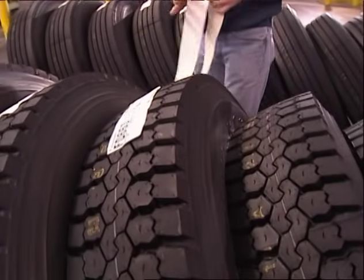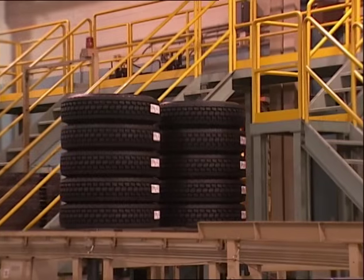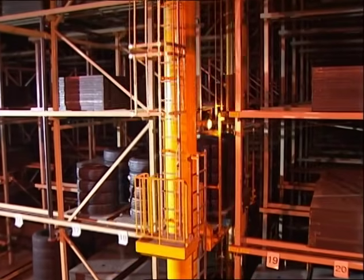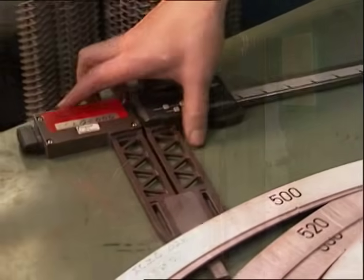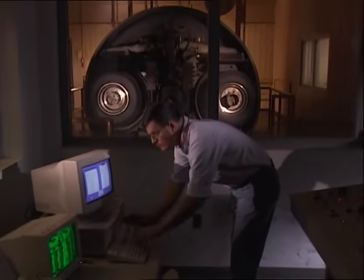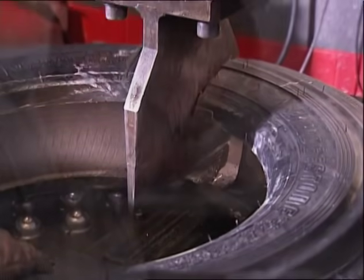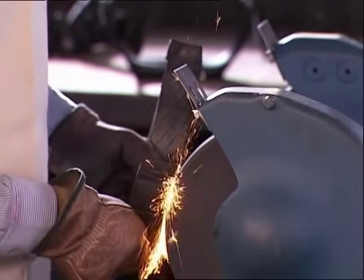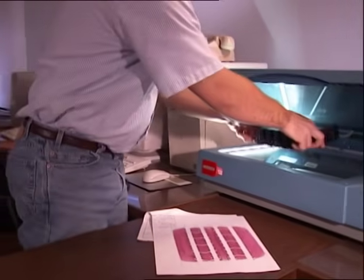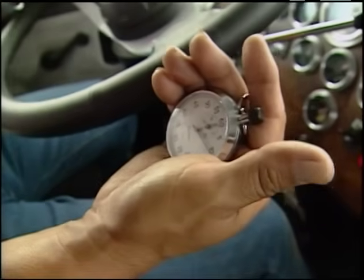Tread patterns and sizes are sorted, labels are applied, and the tires are sent to warehouse areas for shipment. At this plant, a robotic warehouse system stacks, stores, and retrieves finished tires to fill orders without requiring any human labor. Quality control still hasn't ended — Bridgestone Firestone technicians routinely pull random samples for testing. Tires are tortured on test drums, punctured by hydraulic rams, cut up, and examined with microscopic precision. Technicians compare final products to specifications, looking for variations that could diminish performance, tread life, or retreadability. It can take weeks to test a tire, but it's an important job because it assures consistent quality.